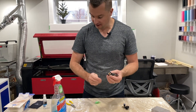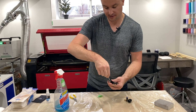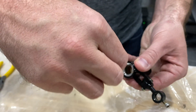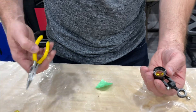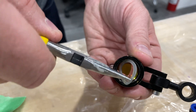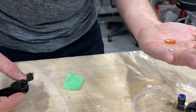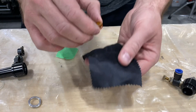On this side I have my lens, so I'm going to quickly clean my lens. You can get a specific tool to undo this little washer here that locks it in place — I just use a little flat head screwdriver. I'm going to unscrew that. If you have received your laser from the factory, you will likely not have this other little white washer in there, and that is something I do recommend you purchase. Because if you ever get a little bit of a wobble in your burns, putting that washer in will stop it. I'll take this out — the lens actually doesn't look that bad right now, but I'll clean it anyway.